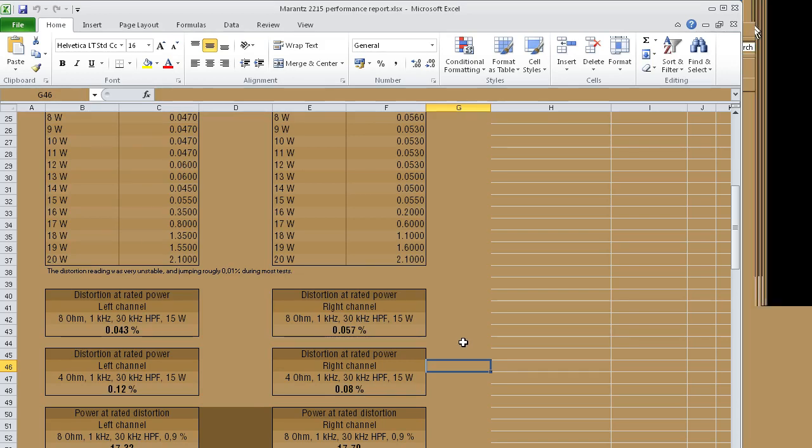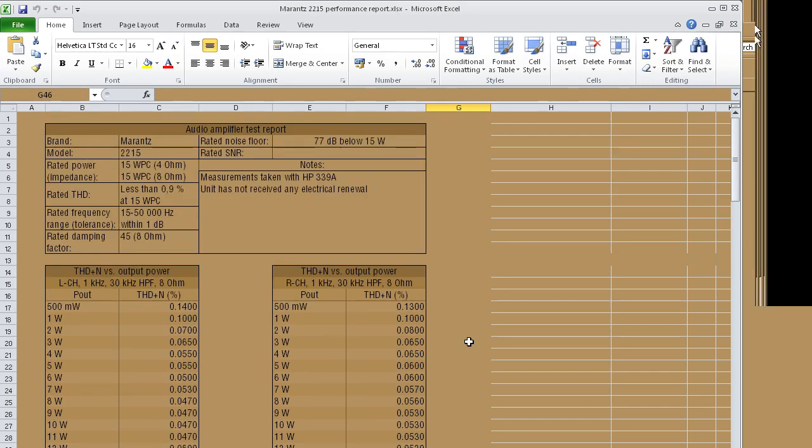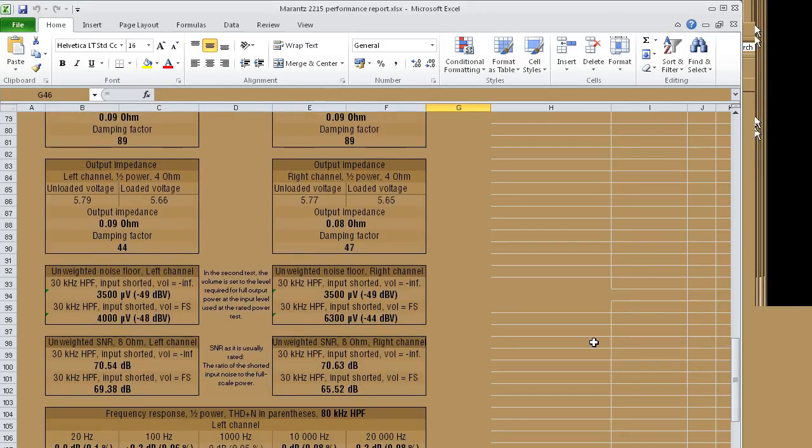Yes, somebody spent a lot more than $20, but that was a long time ago, and this particular one came out of the trash. I paid nothing for it. Of course not Twin Famicom, but this Marantz is actually a very poor performer. It's not a very good amplifier. It's extremely noisy, mostly if we look at the noise specs. It's got 3.5 millivolts of noise. A real hiss maker.